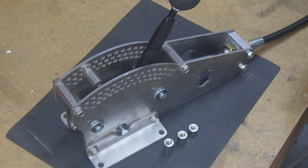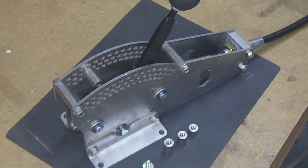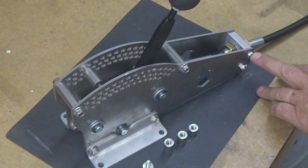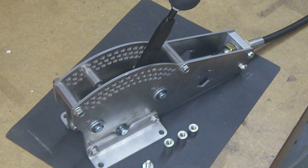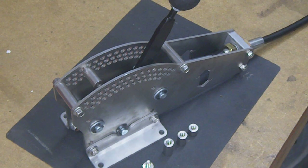The fasteners have the self-locking technique on them, so Loctite, tighten them down, and they're going to be good to go. Back here we're using nylock nuts for vibrations, and there isn't really a heat problem to worry about the nylon softening. I went with the nylocks here. So that's kind of the basics of how it's all going to work.